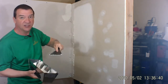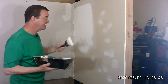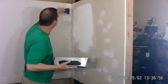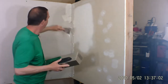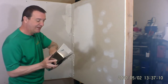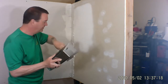Just because it's a little different and you might have a different technique than I do, but I want to show you different ways of doing it so you can develop your own way. So you can't say, well, he said just go straight down. No, I didn't say just go straight down. Let's try different things. As long as you're getting it into the crease, into the 90 degree angle, into the corner itself, we're going to be good. And we want to stay out at least as far as the 4 inch knife, so when we put the tape on, it's over. We're not going to have any problems with the tape going over the mud.